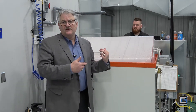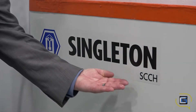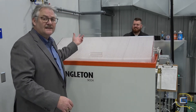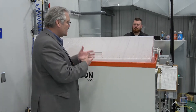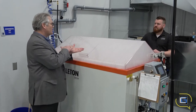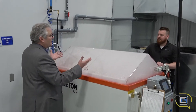The goal is to verify that you don't have any corrosion issues and maintain a high quality box in delivery. At Crystal Group, we've had enough requests from customers that we actually bought a salt fog machine here, and there's currently a test going on inside it. I'm here with one of our talented compliance engineers, Jared Christensen. We can test entire units, or you can test samples — things like conformal coating to protect a unit, or surface treatment of aluminums or steels.